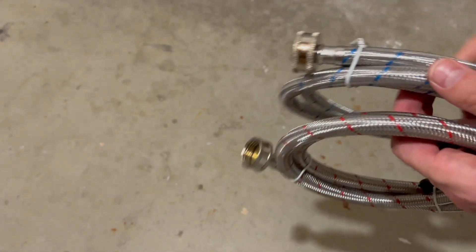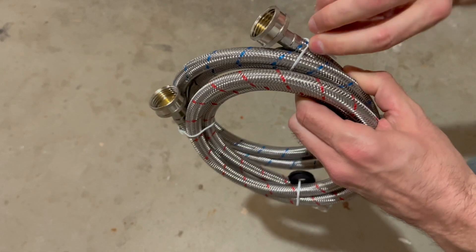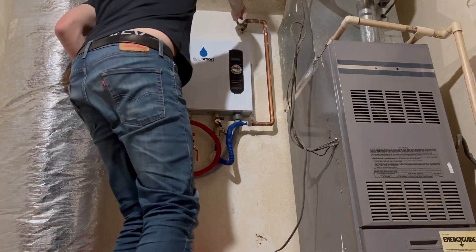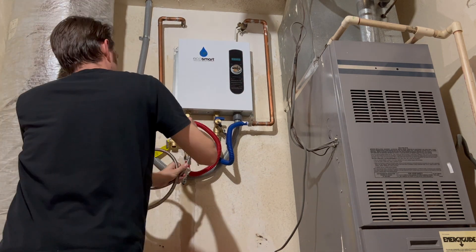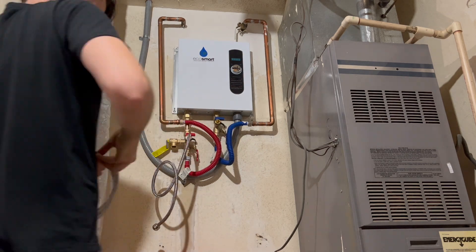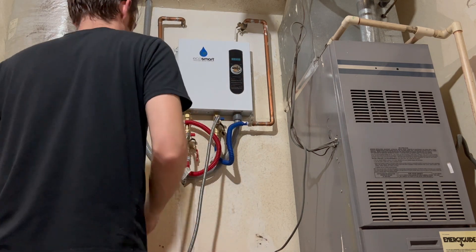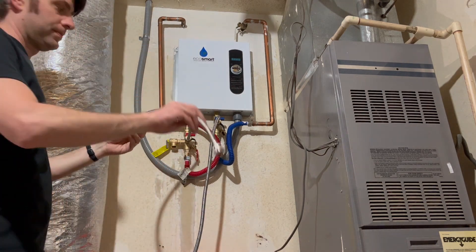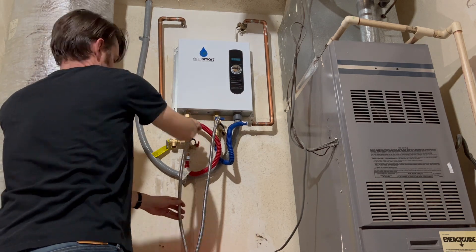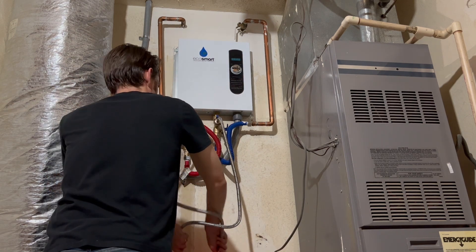Once you're confident enough in your connections, let's try these valves out. I'm not an expert on this, so consult your manual, but here's how I did it. To flush the water heater, you can buy a full kit that comes with a pump and hoses and a bucket, but these are actually just washing machine hoses, so I bought the different parts separately. With your water shut off — and this is an important part, shut off your water if you haven't already — open the caps on the flush valves and connect the washer hoses. Once you've connected those hoses, close the valve handles on the side of the valves and open the handles on the top. This will prevent cold water from coming into the water heater and prevent the cleaning fluid from going into your plumbing. You want to create a cycle between the water heater and the bucket of cleaning fluid.